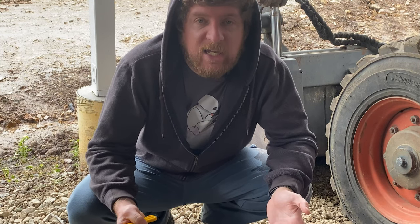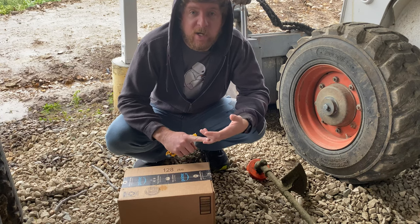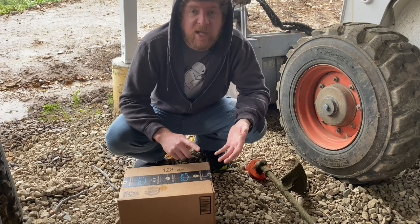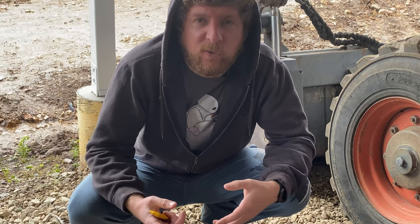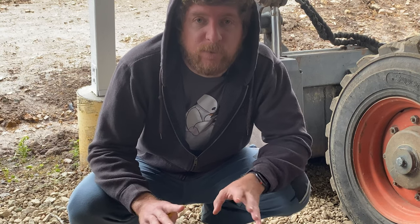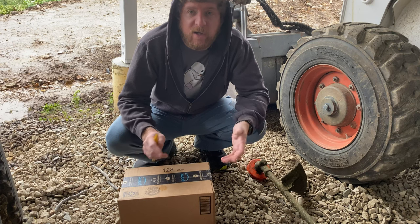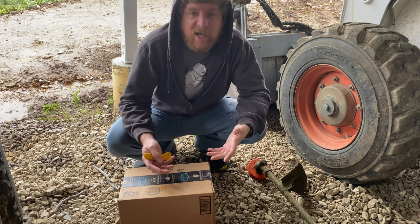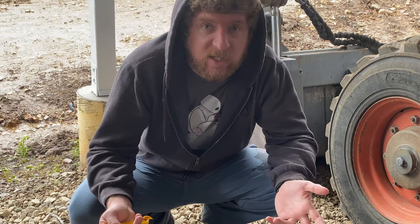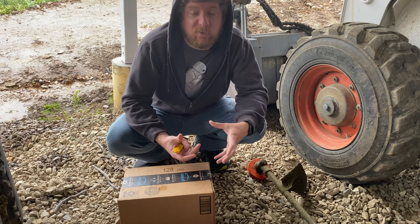You know, it may eat through it, but I'm going to use a rust reformer. You're supposed to spray directly on the rust. You're not supposed to pre-treat it at all, and then you can paint over that. It's supposed to have a chemical reaction with the rust that turns it into like a binding agent. I'm not fully sure what happens with that, but that's what you're supposed to do. So I'm just going to spray that on it, maybe a couple light coats, and at least I will get the visible rust under control and get the surfaces protected. In theory.